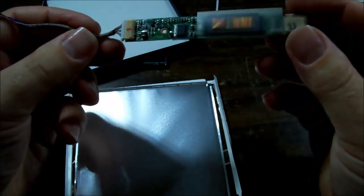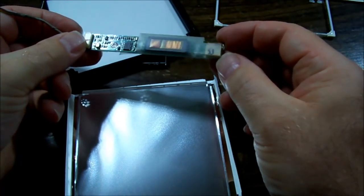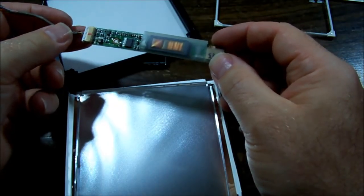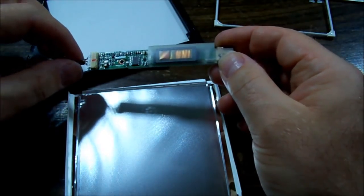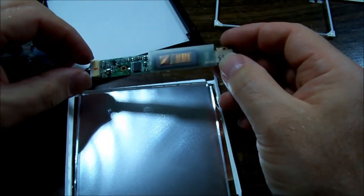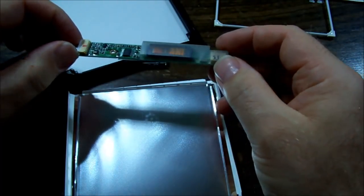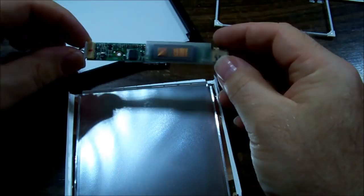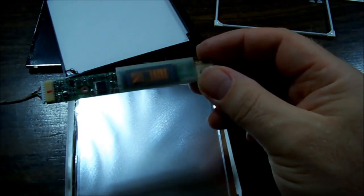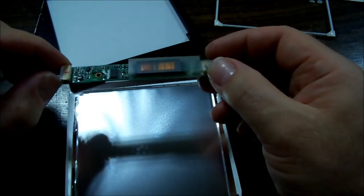Let's see what's available for a driver. So what if I took something like this out of a laptop screen and see if I can make that work? I'm sure it can't be that difficult. I know there's a bunch of wires going to it though. Must be doing some fancy control for the brightness of it perhaps. But there's going to be a power, a ground, and at least an enable. We can only try. Might save a lot of headaches. We could probably still fit an LED strip in there, but this would be a lot simpler. And I know there's universal driver boards available, but I want to do it now. I don't want to wait 3 weeks to get one from China.